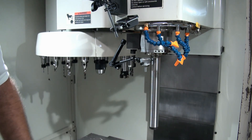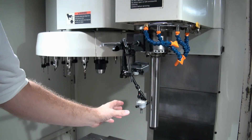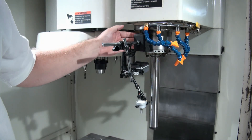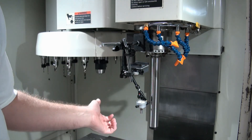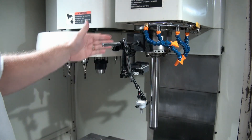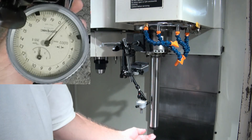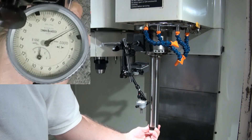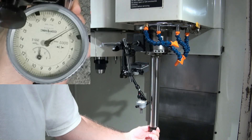That's not entirely the truth. Let's see what happens when we move the indicator down lower on the bar. We moved our test indicator down — this is as far as my NOGA arm can reach. When making these measurements, you want the indicator anchored to the spindle housing so you're not inducing any error or deflection during push-pull tests. It's all relative to the spindle housing. We're approximately eight inches down the bar now. Let's rotate the spindle again — and wow, look at that. We went from a perfect spindle to having about 0.02 millimeters of runout.